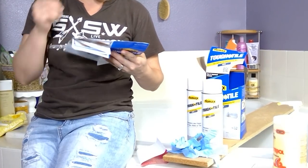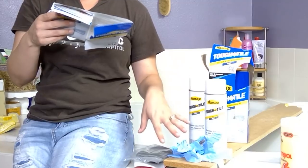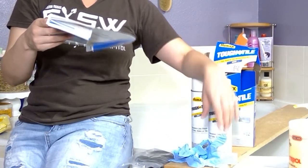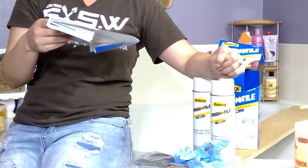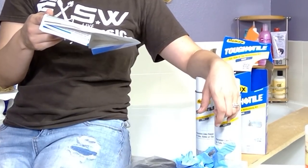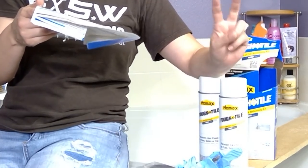Rinse the area thoroughly with water. Scrub the surface with an abrasive pad, which I'm assuming is why they provided these. Rinse the area thoroughly again with water for heavy duty cleaning. Remove dust, hard water, and mineral residues. Scour the entire surface with steel wool or fine wet dry sandpaper using a small circular motion. Then fill a clean bucket with one gallon of warm water and add that cleaner to it, mix it up, and use a sponge to clean the entire surface area. Rinse thoroughly and repeat steps seven and eight one more time for a total of two cleanings.